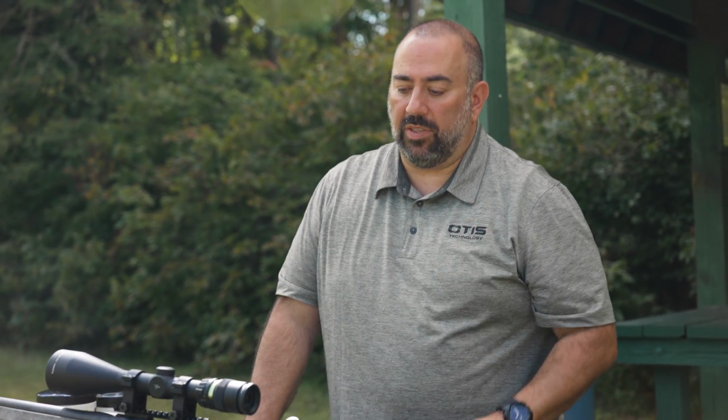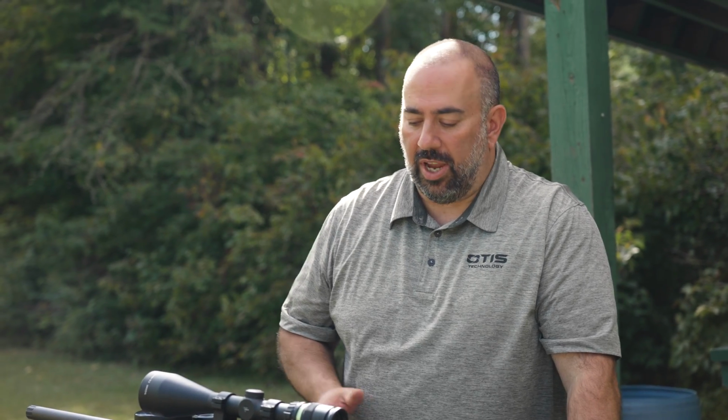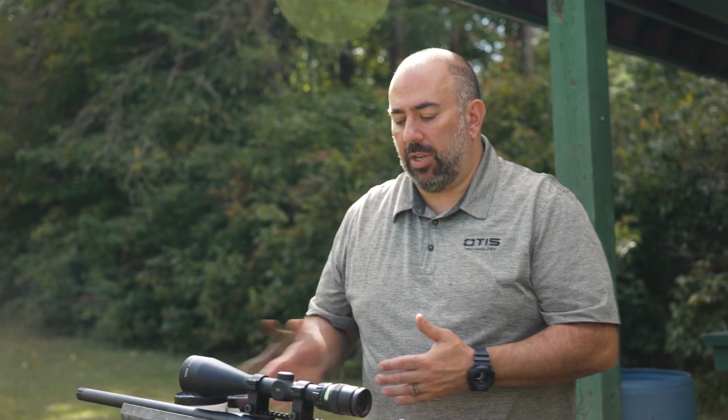People talk about lapping the barrel and things like that. Unless you're a certified gunsmith and you're going to do that, with firearms today you don't need to. If it's a bench gun and you're shooting super long range competition stuff, there's some validity to doing a couple of things like that. But for varmint hunting, sport shooting, target shooting, cleaning between each shot is a great procedure to break it in.